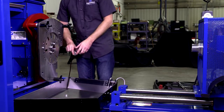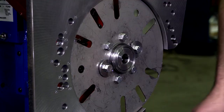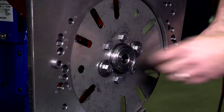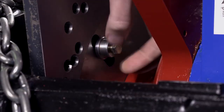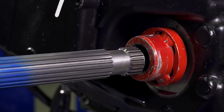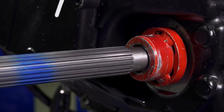The pilot bushing is then installed into the master pilot sleeve and it will align the converter to the flex plate and the input drive. The transmission is then mounted to the master plate using its dowel pins for alignment and bell housing bolts to secure it. The back of the torque converter is bolted to the flex plate using spool spacers to set converter depth and also drive the converter. Lastly, the splined output adapter is installed in the transmission and connected to the load units with splined output shafts.